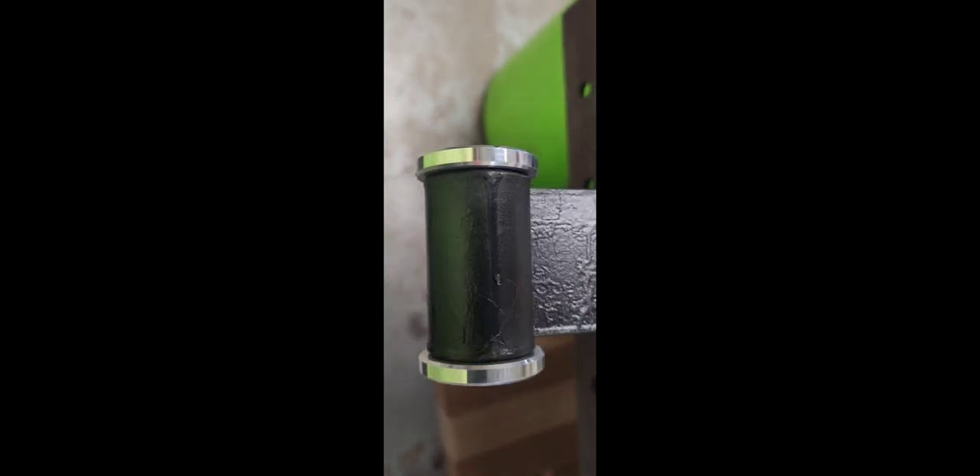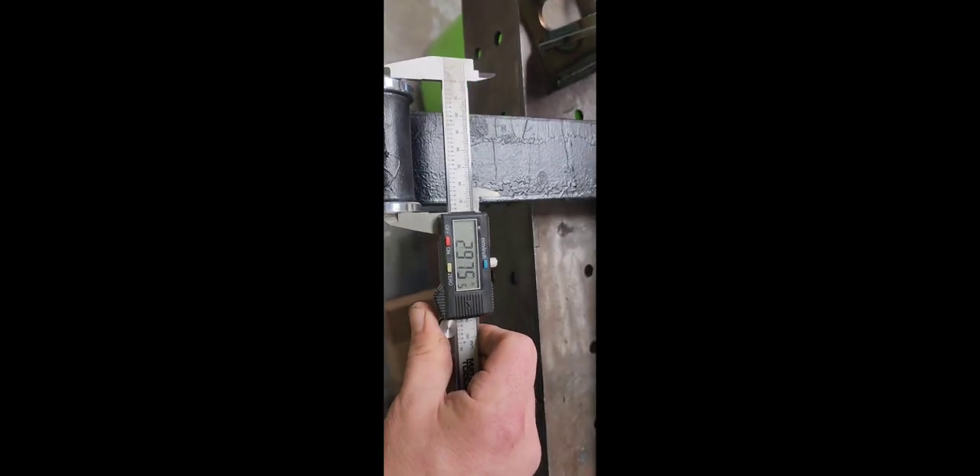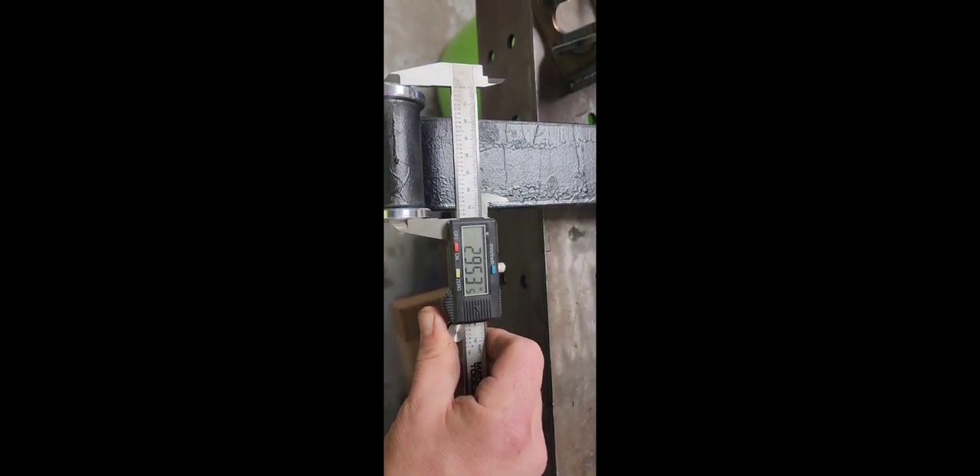Both sides of the bushings are pressed in and you can see they sit flat on both edges. It's measuring two-point-nine-five-five inches, so it's forty thousandths smaller than three inches. That gives you twenty thousandths on each side of additional clearance for the inside of the slider body, which is going to make this thing easy to assemble — that's exactly what we're looking for.